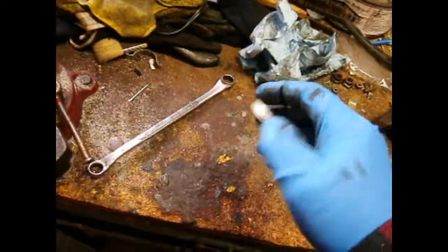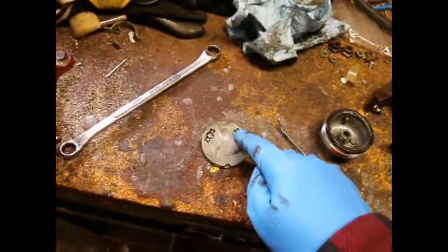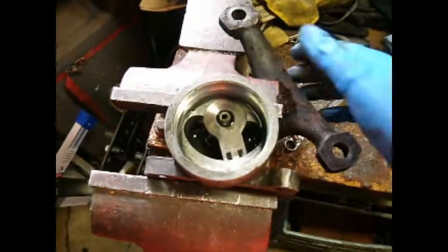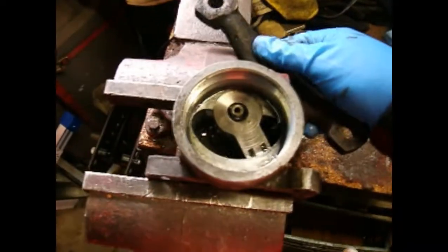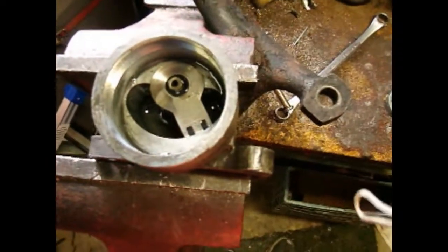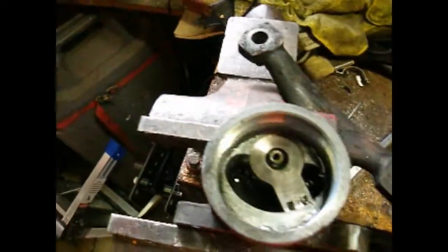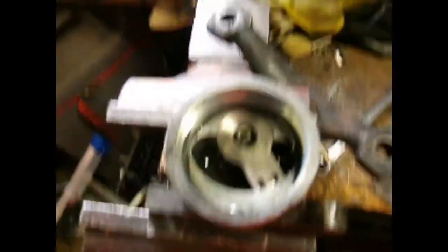Here's the plate. It's got an alignment notch, and these two devices - not quite sure what they're for. This is the inside, and that is a wiper, because this is also a steering damper. There's actually a tiny amount of oil left in this, but I expect it should be full, and that's what that bolt hole is for - to put, I expect, 90-weight gear lube in there. Let's take some more apart and see how it works.